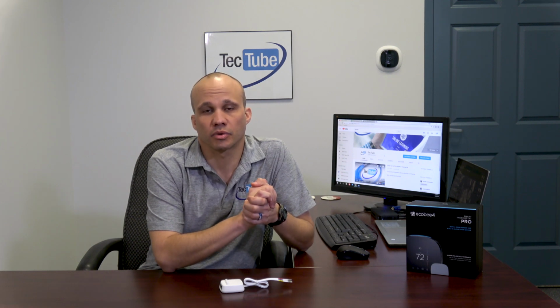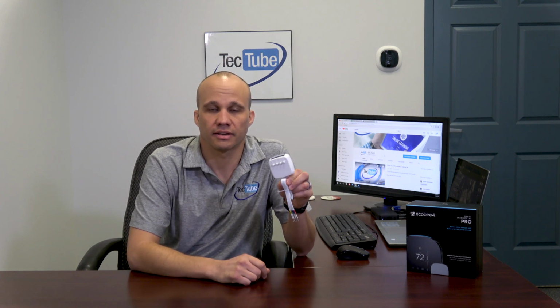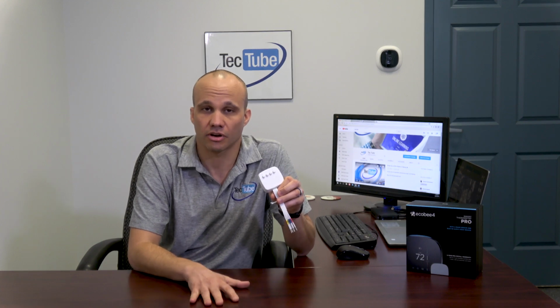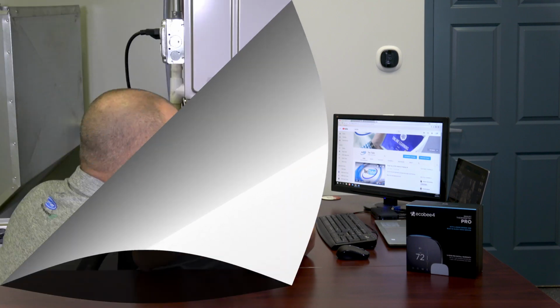In this particular series, we're going to show you how to install a PEK kit, Power Extender Kit. This kit is used when you do not have enough wires in the wall. You need to make a 4-wire application into a 5-wire scenario because the ecobee needs a common wire. So we're going to use this kit to accomplish that without pulling new wires to the wall. So let's get started with that wiring project.